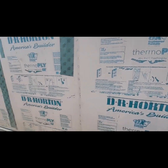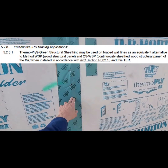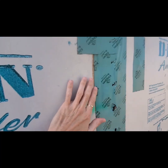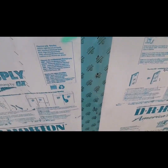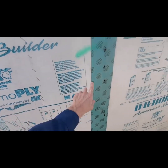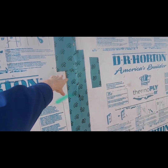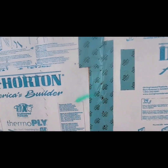This stuff pops right out. Now, supposedly this cellulose sheathing — which is essentially cardboard — if installed according to manufacturer's instructions, meets the same requirements as 3/8-inch OSB. But look at this — it's all depressed in. The staples didn't even hit it, so they just taped it instead of putting another stud in and stapling it to something solid. This is structural sheathing — there's no strength in the structural portion if it's not stapled. And of course the weather-resistant barrier is compromised when this tape is ripped out like that.